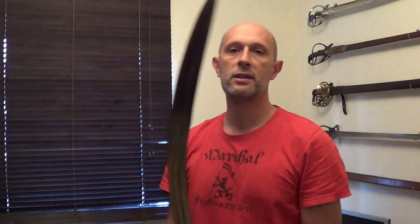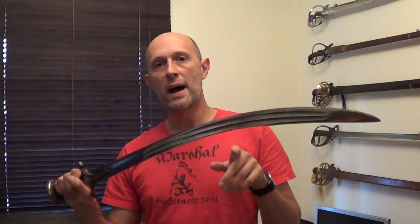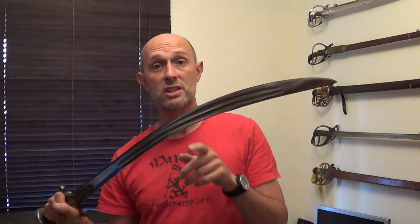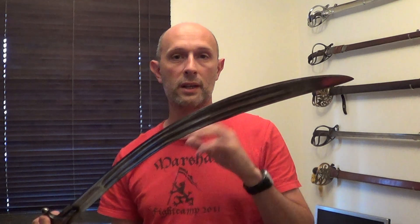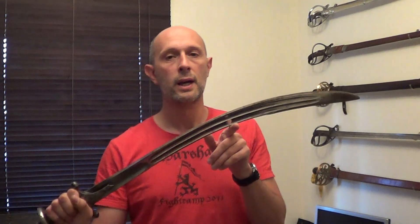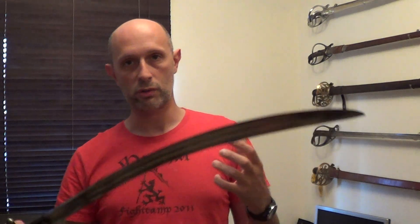It's not only Japanese swords that applies to. Some Indian swords were made on a similar basis, and I've had Afghan and Indian weapons that I have gingerly straightened by hand and they've proven to be relatively soft. Whilst the edge was hard — so I imagine they were in some way edge-quenched or even perhaps hammer-hardened — lots of aspects of Asian sword making are now lost and forgotten. But some Indian swords are not spring-tempered in the way that most European swords are.